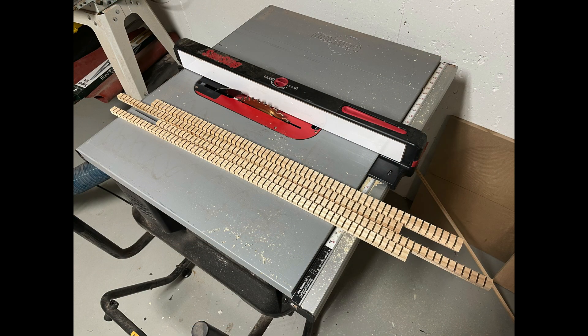Here's the end result. If you look at the rightmost one, you can see the 30 degree angle on the kerfing. That's really just for decoration, but it's the cuts that go across the wood that help it to be bendy. And with that, that's the kerfing I'm going to use on my acoustic guitar.